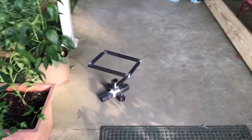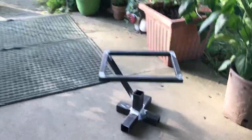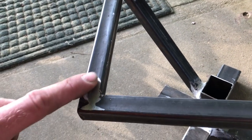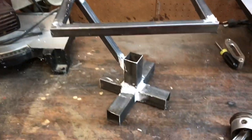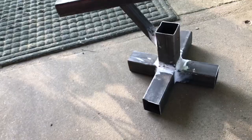There's the piece sitting there drying, looks really cool. You can see how the welds turned out - turned out real nice. Welded and then grinded off the weld, want to leave that real flat for the speaker to sit on. I put caulking over all the welds to get it nice and smooth because it'll be around people touching it. All that caulking over the welds is already dry, nice and soft to the touch. Filled in the little holes on the ends.